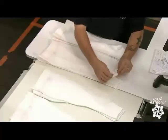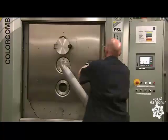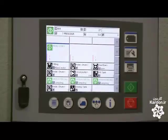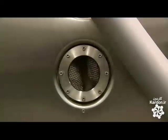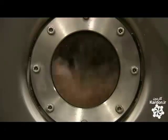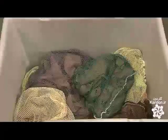Workers group the stockings into 10-pair stacks, put each stack inside a specific color bag to identify its style and size, then load the bags into a high-tech dye machine. They key in the program, which automatically controls every aspect of dyeing — from water levels and temperature to dye injection. For one hour the machine washes the stockings, then over the next five hours it dyes them, adding chemicals to make the water acidic, which draws the dye, like a sponge, permanently into the yarn fibers.